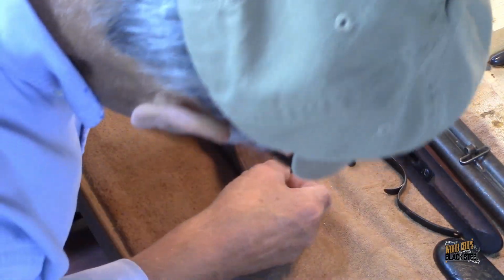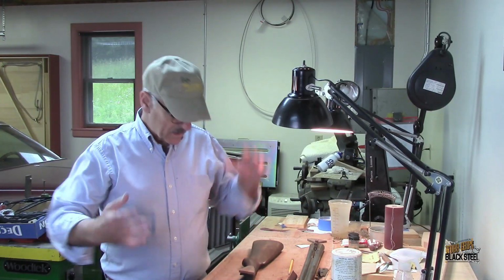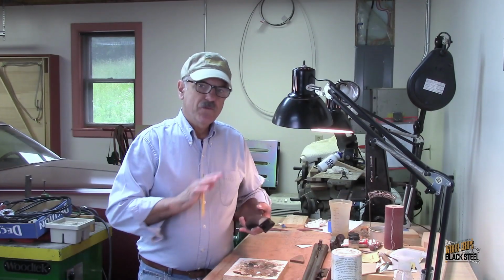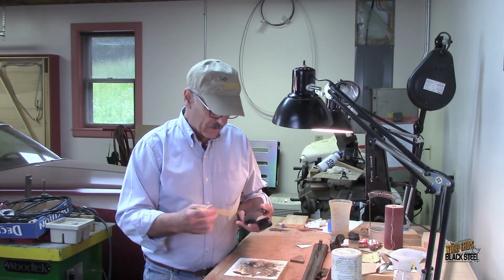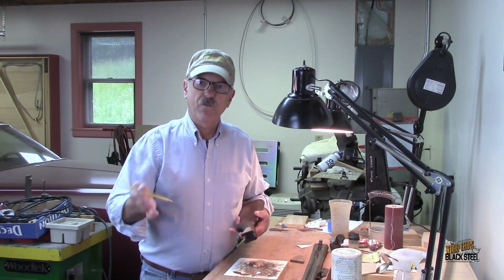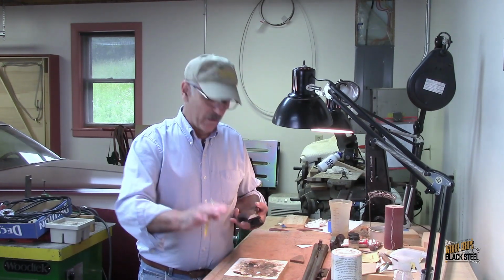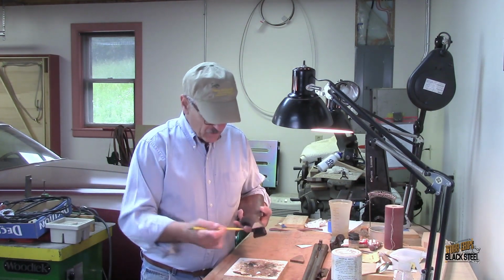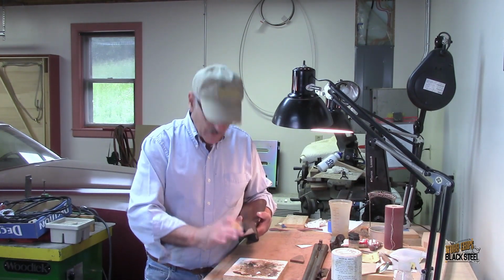All right, I've got nothing else to do to prep these, so let's mix up some epoxy and get this thing sandwiched together. If you've been a regular viewer or visitor to this channel, then you know that when I cut this on the mill, it exposed a lot of oils underneath. Over the last several days, I've been using acetone to try and draw away the oil. In fact, my last application was about half an hour ago, so that we've got this nice and bright, so that we've removed as much of that oil as we can.